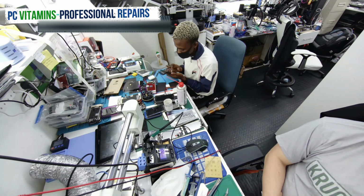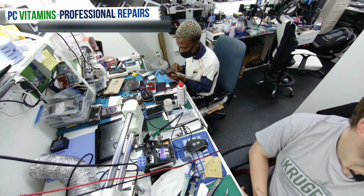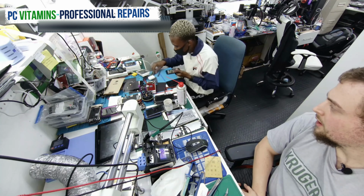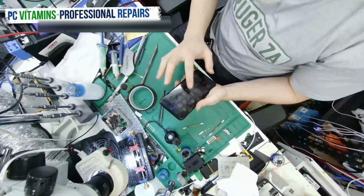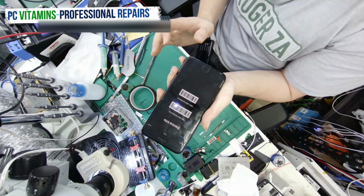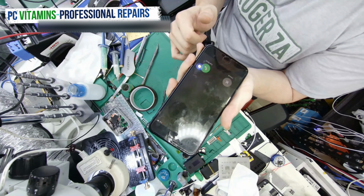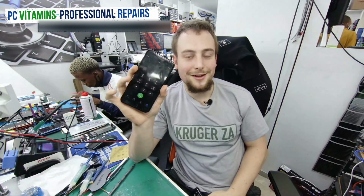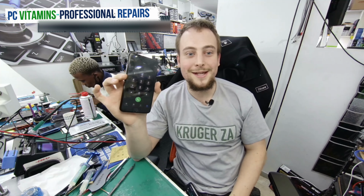Not dead, which is always a good thing. So let's see if sound is working or not. Yes. Okay, first I check if baseband is up. Sometimes if baseband is up and working, there we go. So that means the sound IC is fixed. Both pluses done in 1 hour. iPhone 6 Plus touch disease, iPhone 7 sound IC.